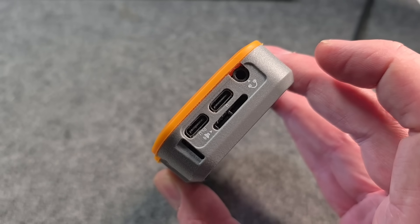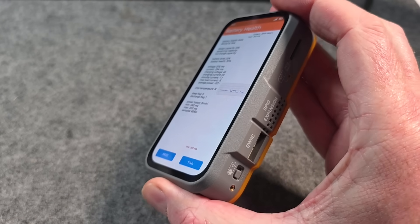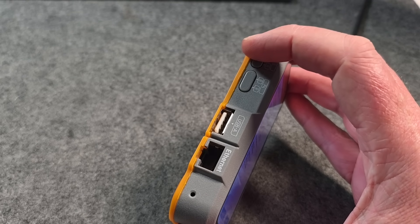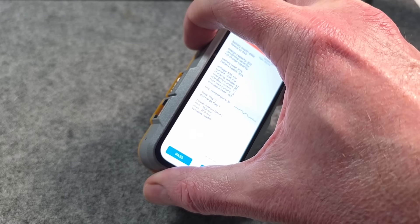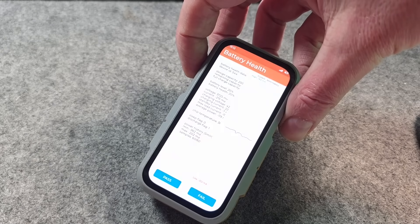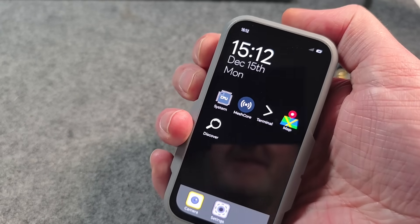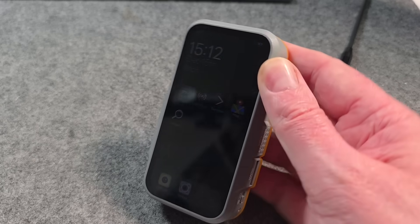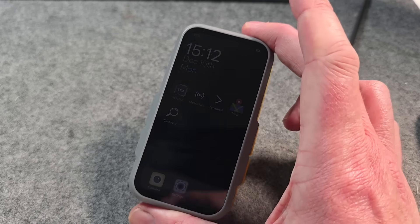The device also has sound — there's a headphone socket, so you could make a little MP3 player or app for that. There's also a speaker in the bottom, so notification sounds work, no problem. There's an SD card for storing sound files, a proper hardware on/off switch on the side, and two user buttons up and down, plus reset and boot buttons. I've got an always-on display feature — if you hold the boot button down, it dims to one step and saves energy while keeping your clock on. It's quite nice on charge at night — it acts like the always-on OLED display on a modern phone.